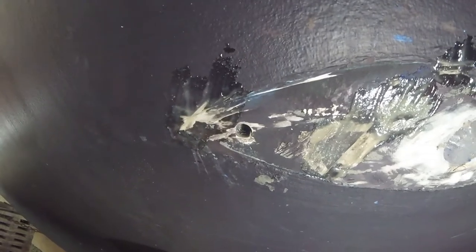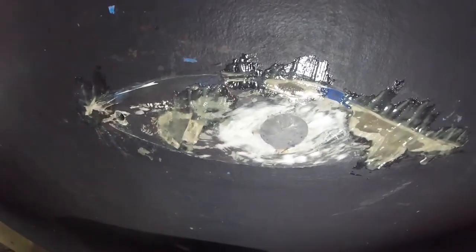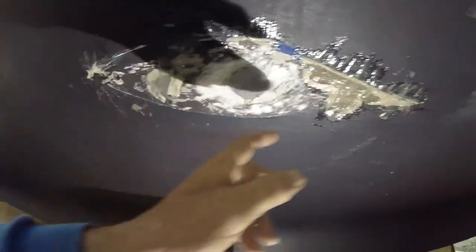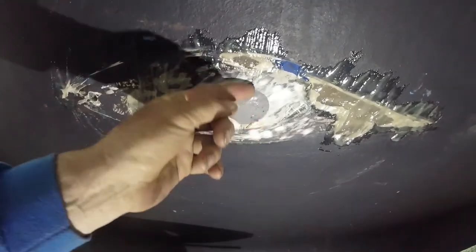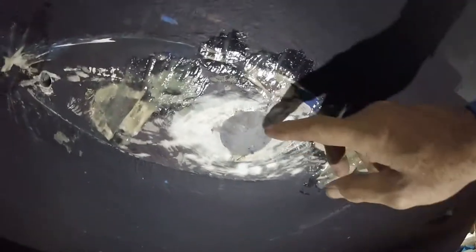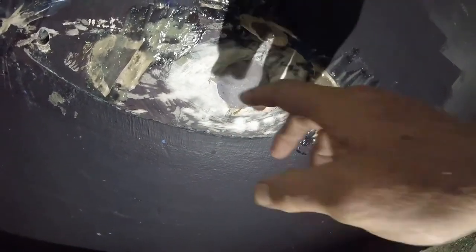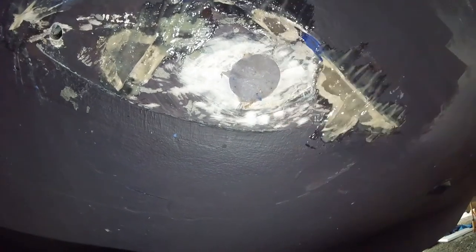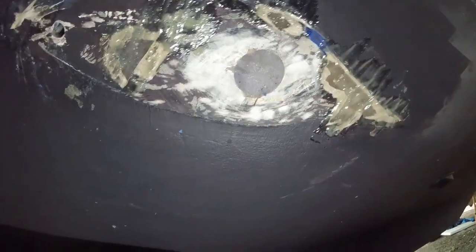Turns out this hole for the old transducer will fit the new one, and it turns out that the space between here and here is adequate, so we'll only be doing one hole. So we're going to get the whole thing completely assembled, including this on, and including the transducer on, before we even drill this very last hole. And now that this is completely full and rock hard, that foam on the inside is encapsulated with resin. So we'll drill a hole bigger than the stem of the cable gland, big enough so it could handle some new 5200 on the side of the nice new glass. You don't want to try to put 5200 on the side of foam when you have a foam core boat, and most big sport fishers are.